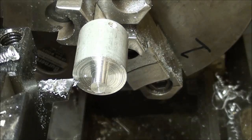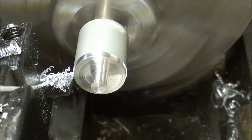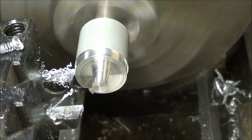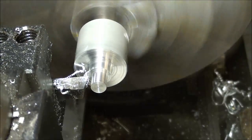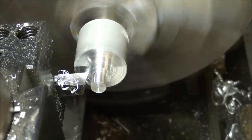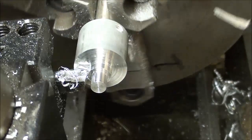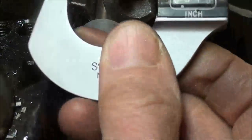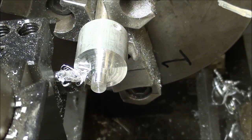This will be the second step — it's three-eighths diameter, that's .375, and that's three-sixteenths wide. This will be the last pass for this step. Right on to .375 is what I want, so that one's right on. Now I'll do several steps off camera.